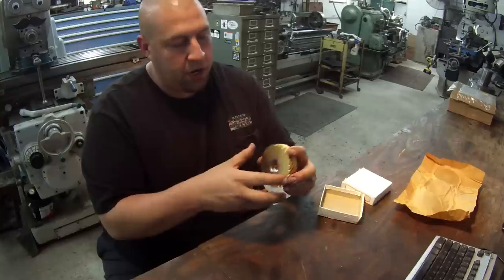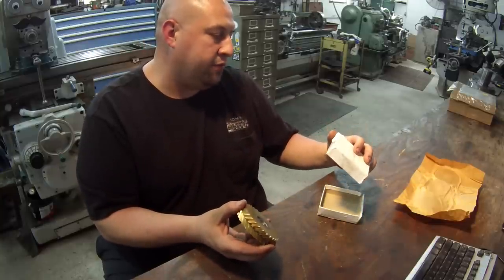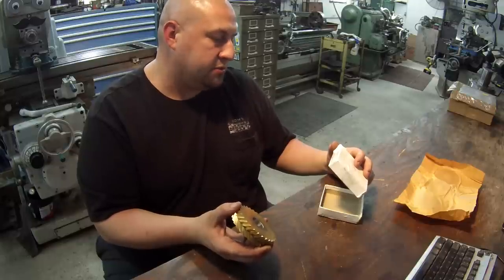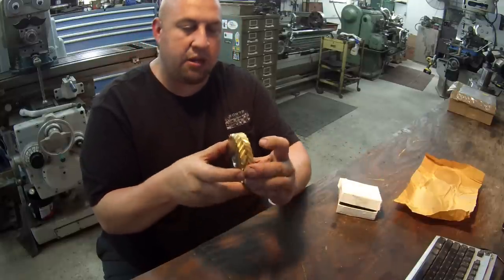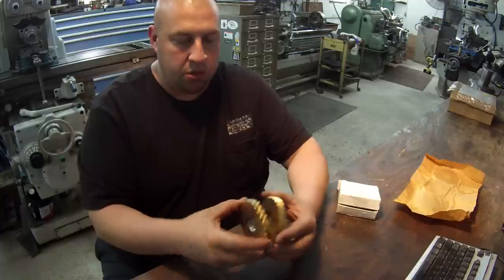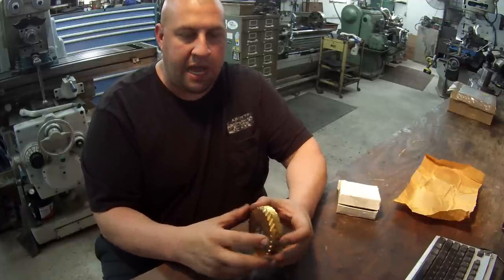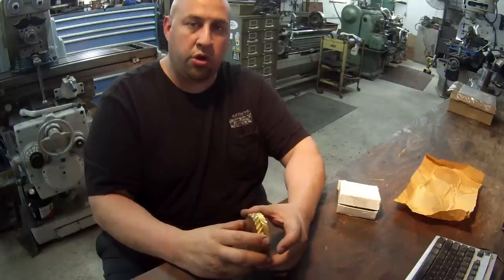So he sent me this pair of cutters, and they are 3.5 inches in diameter, and the width is 0.04, with a 1-inch arbor. It's a right hand and a left hand, so you could actually stack them on your arbor and have a right and a left hand cut, or you can just use one at a time if you want to. A 0.04 cutter isn't, I don't believe, real common, but